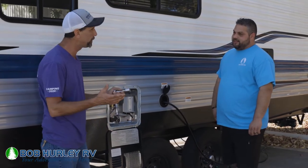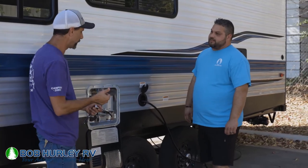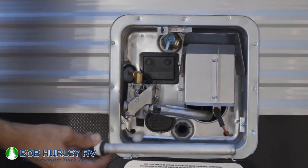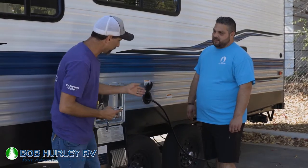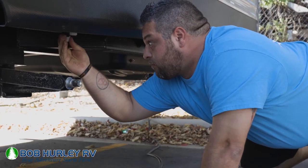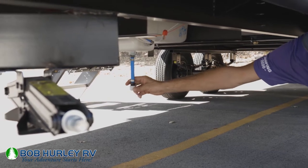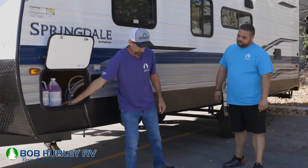We have a Suburban water heater on this one. The Dometic has a white nylon nut right in the center — you just pull it out. This one has an anode rod that helps protect the porcelain. I've already got it broken loose, so I'm going to pull it out. You always want to pull it out and inspect it once a year — winterizing gives you a good time to do that. Now Derrick, reach up underneath there — there are two low point drains. Undo those caps and set them aside so we don't lose them. There's another one here for the fresh water tank that we want to undo as well.